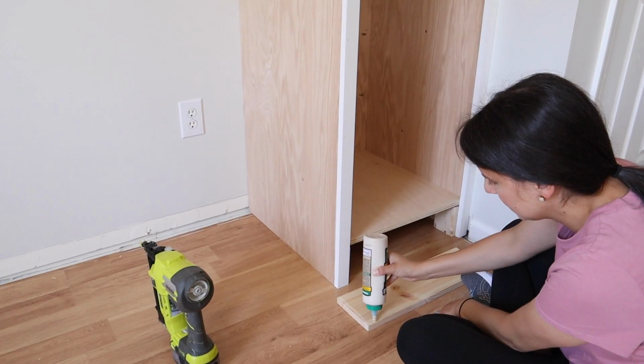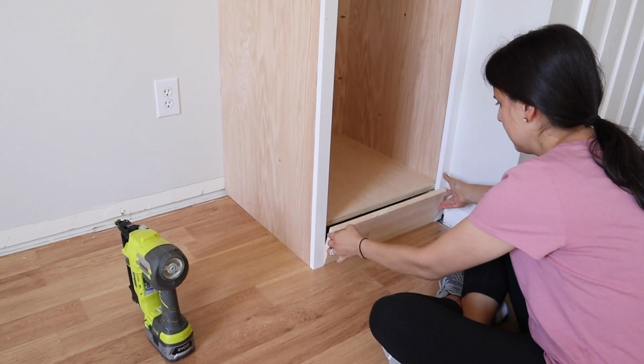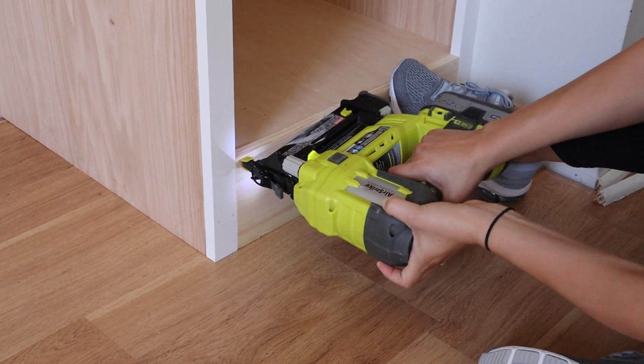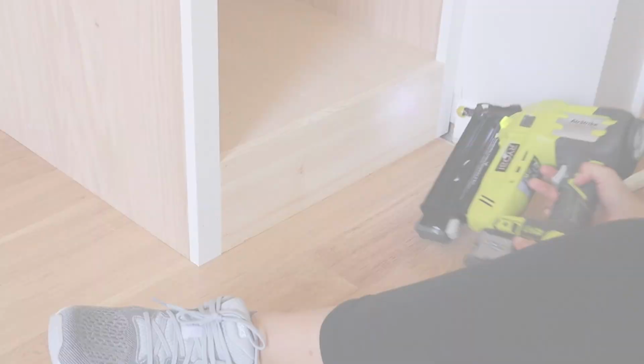Then I finished off the bottom with another 1x6 board. If I were to do this again though, I would have done the 1x2 trim all the way up the sides with the top 1x6 board in between them, like I did with the bottom 1x6 board, for a more seamless look on the sides. It's alright though, I can fill all the seams in with caulk and wood filler.